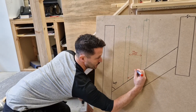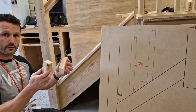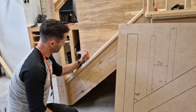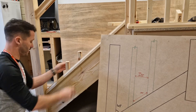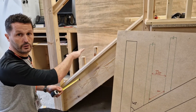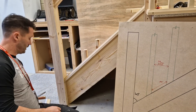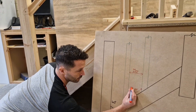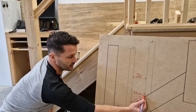We need to work out what that measurement is there. So how we do that is we'll get two sacrificial pieces of spindles and we'll place one in. I've made a mark on it just for a reference point, and we'll place the other one in there. You need to make sure that that is 99mm apart, horizontal. And then by doing that you can work out what your measurement is on the rake. So from that to that, down that linear measurement is 128. So the maximum of our rake angle is 128.